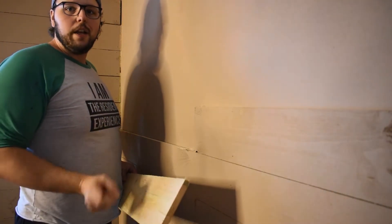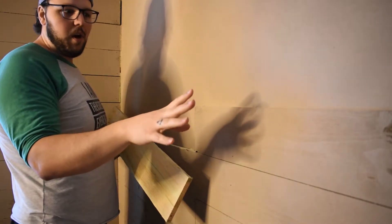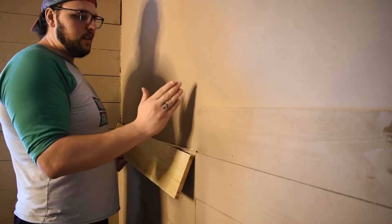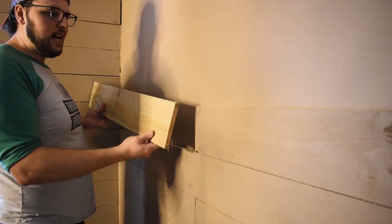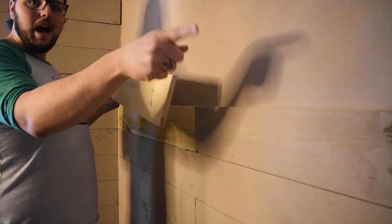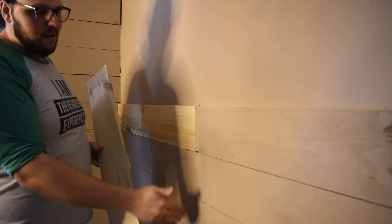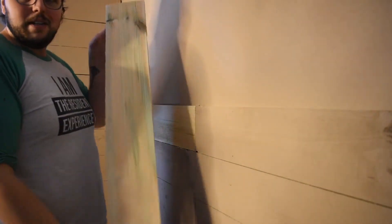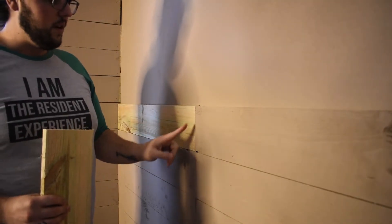When putting these on the wall, you'll have portions where a full plank runs the whole wall and portions where you have to cut. From here to the corner won't be a full plank, so you measure and cut the size you need. What you want to do with the leftover piece is start at the opposite end of the wall, so the joint lines stagger and don't line up perfectly. Keep alternating like that to offset your joint lines.